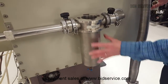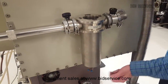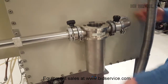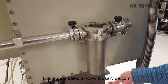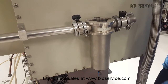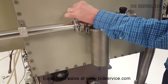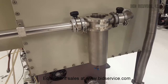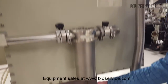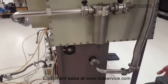You'll freeze the water vapor onto here — the inside of the trap — with the liquid nitrogen inside. Then what you do is close this off. Once the trap warms up, you can drain the water vapor off from this line down here. We're just running this open right now with no liquid nitrogen. So you can see here's the line that comes out from the box, goes down into here into the purifier, then the blower, and then back into the box. These lines will probably be taken off for shipping, so you'll have to put them back on once again.